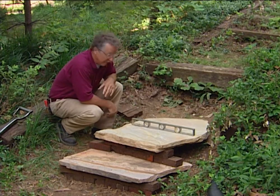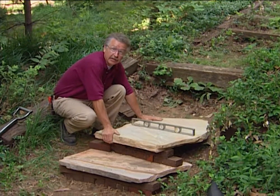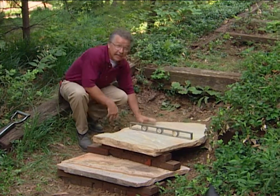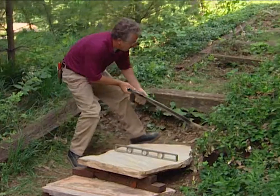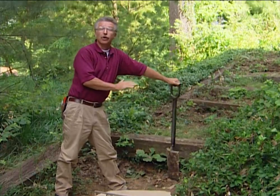Here's another important factor, and that's wobble. If someone heavier than me puts their foot on this part of the tread, this stone will move, and the way to solve that is to place two more bricks underneath it to support this corner. They have to be seated on firm soil, the same as every tread. We're going to move up the slope now, and we're going to have to shave soil out so that the back of our treads are seated on firm soil.